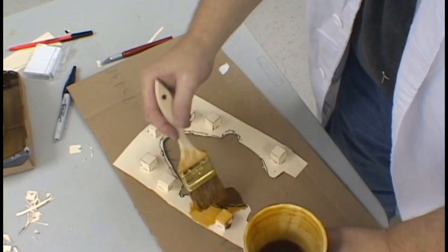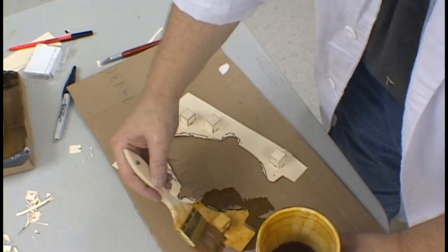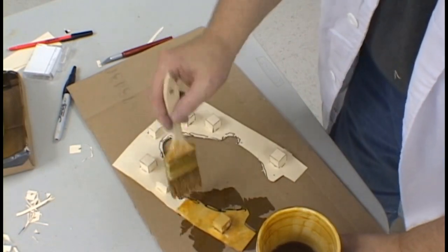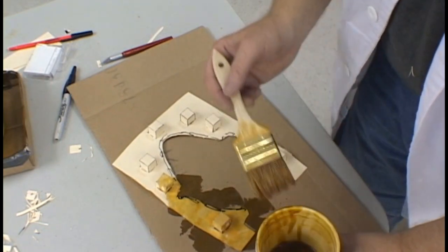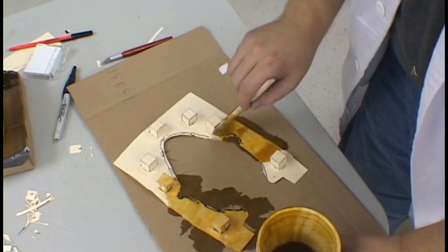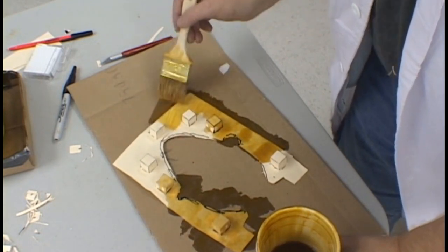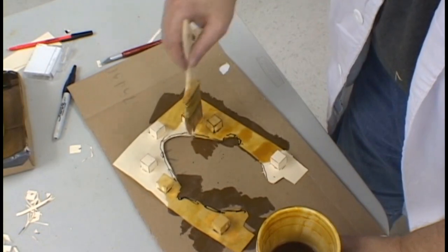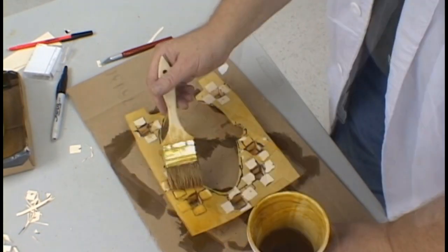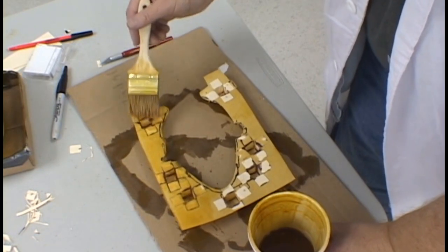After you have finished assembling the parting plane and checked it for fit on the model, it is time to coat it with shellac. It is necessary to coat it with shellac as well as the model, so it allows for an easy release from the latex rubber. Make sure that you coat both sides of the parting plane with the shellac.